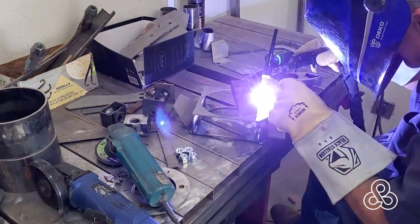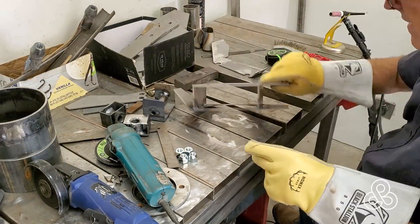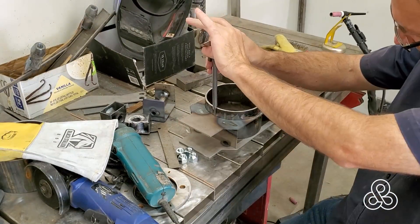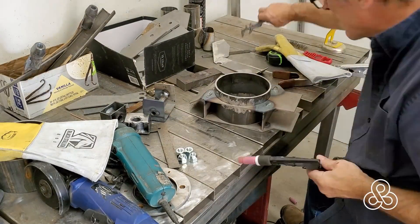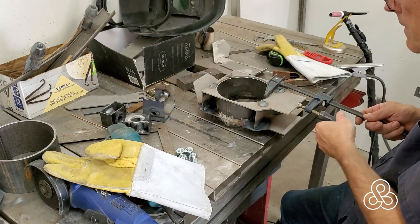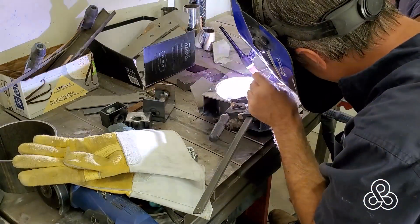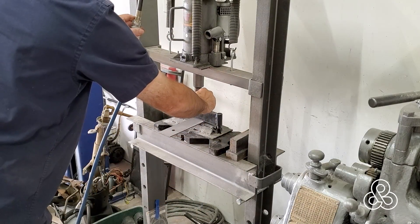Here's the other side — same thing, just going to go in reverse this time and weld the slots and tabs first. Then I'm going to drop in the piece of six inch pipe that's going to make the main structure of this upright. There's a little bit of warpage from welding the perpendicular plates to these two main plates, so I'm going to check it for square on the side where it's going to hook to the wheel — the main hub side. Once I flip it over I can see there's a little distortion, so I'll throw some clamps on to draw it back into position and tack weld it. I'm just going to tack weld that main tube in place because I've got a lot of things to fit around it, and if anything goes wrong I want to be able to get it out easily.